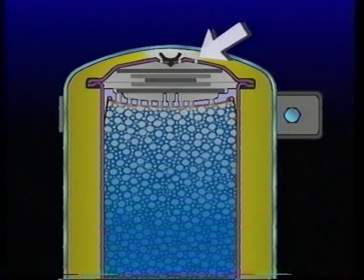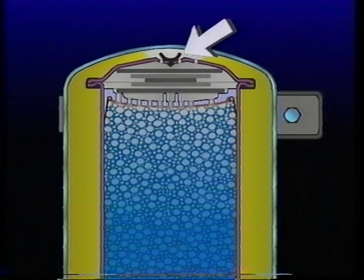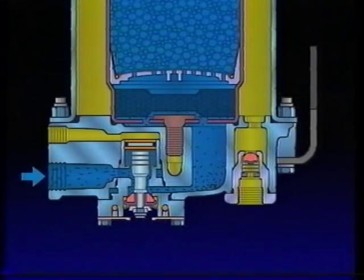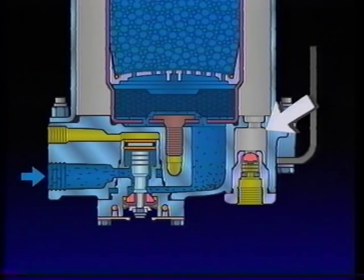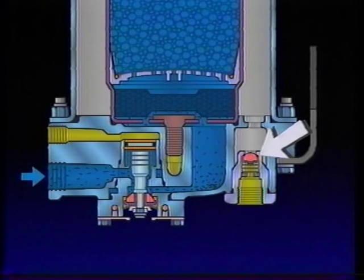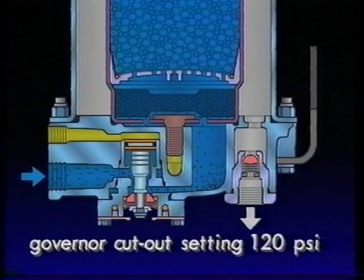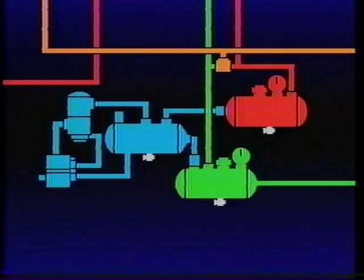While some air will flow through the orifice adjacent to the check valve, the majority of the dry air exits the desiccant cartridge through its integral check valve to fill the purge volume between the desiccant cartridge and outer shell. Dry air in the purge volume flows toward the end cover and passes through the single check valve, out the delivery port, and to the supply reservoir. The air dryer will remain in the charge cycle until air brake system pressure reaches the governor cutout setting of 120 PSI.